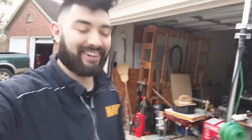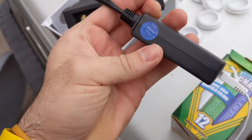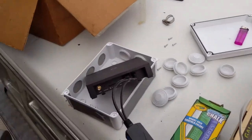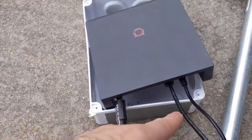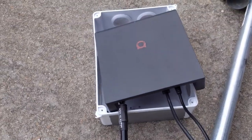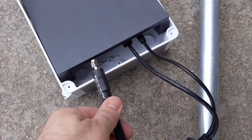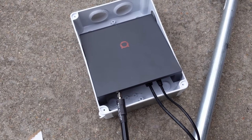This antenna is like 10 to 11 feet tall. I'm doing power over ethernet — this is my PoE splitter. The other half connects right next to your router. I'm using a flat ethernet cable, which works great. First things first: before you start making any holes in your enclosure, plan out how your cables are going to be fed through, because if you don't plan correctly you'll realize it doesn't fit — just like I did here. I ended up using a bigger box and it damaged my cable because the hole was too tight.